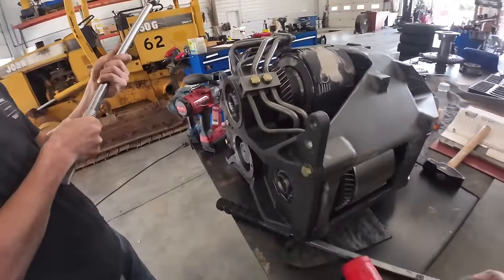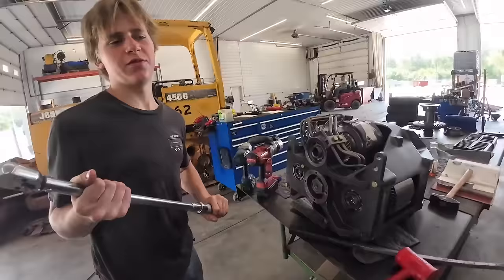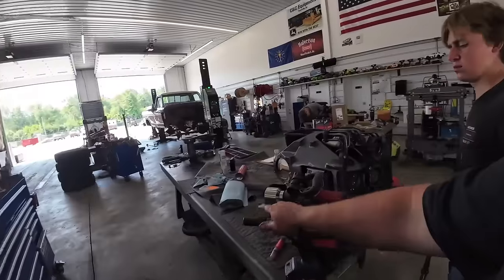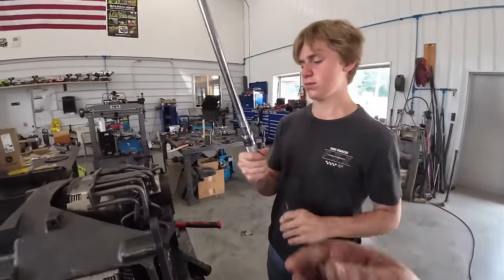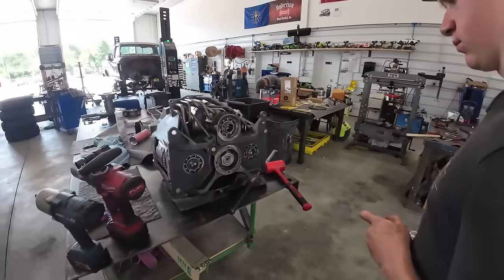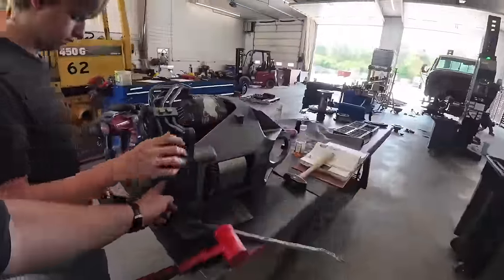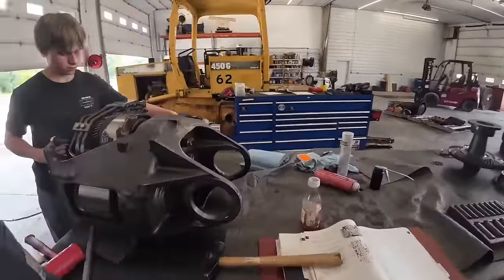All right, we got the front cover slid on there pretty easy. Tucker's going to torque these four bolts down to 96 pound-feet. This is not the first time we torque something. It's because you're here. I know what it's supposed to be. It's a good way to learn. The gear on 96? Yeah. There you go. You want to look at it? Nope. You can read. Can I not? And then this big nut here is supposed to be at 300 foot-pounds. We'll do that to get those torqued. We've got three snap rings to stick on here. And we'll get to the ring and pinion next.